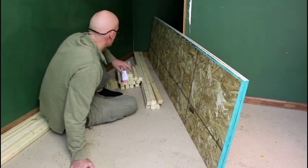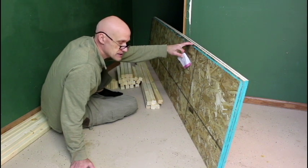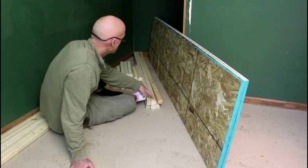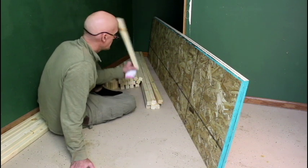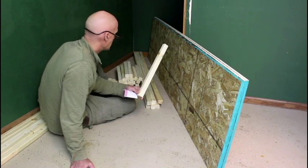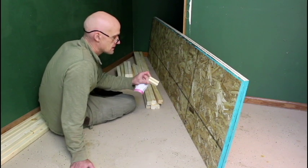In this dark corner of the room I've got the rest of my material. These are the 2x8 half-inch OSB sheets. I also have another six of the straightest 2x2s cut at 65 inches — these are going to be the legs. I've got 18 of these 18-inch pieces, which are going to be support pieces for the legs. And then for the bottom of each leg, I've got six of these cut at 3 inches.